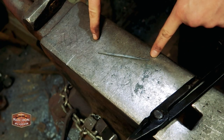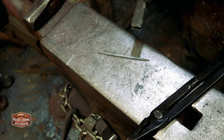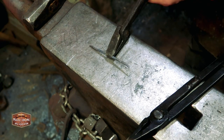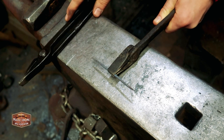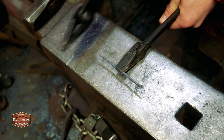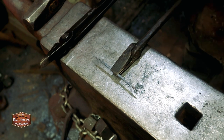We're not perfectly symmetrical, but I'm not too worried about that. What I'm going to do next is put this whole thing in the forge and let it heat up. To form this, we're going to try to use this pair of tongs — I don't need a very wide staple, so I'm going to grab each tip and bend it around. It's going to stray a little bit from the design we came up with on the bench, but we're going to bend around with these tongs, then file these ends a little bit sharper so they go into our plug. And we should have a finished staple.